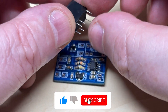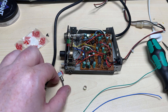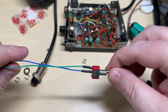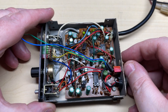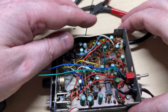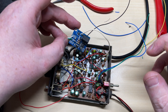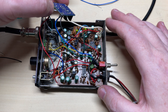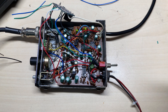He supplies it with the relay not soldered in the board, which I suppose keeps it thin for packaging. We'll put that relay on, but first we need a switch — this switch locks the tones and also switches the bleep on and off. Luckily the hole at the back of the ES880 needed just a little bit of widening and we managed to fit the switch. We've connected some power wires from the back of the board, and here we've intercepted the transmit and receive signals that go to the radio, and taken a wire from the back of the microphone socket for the PTT and the injection of the audio. So that's it all wired up.